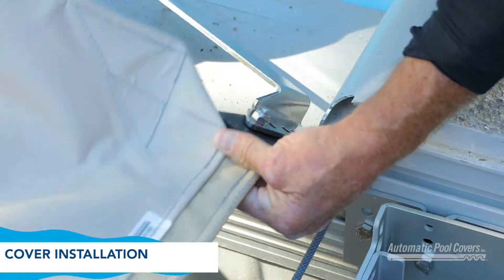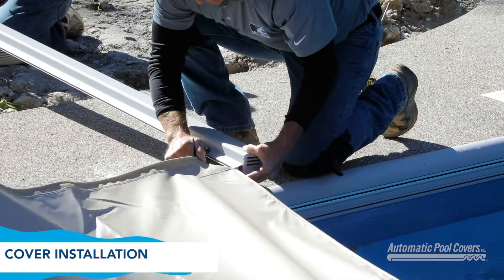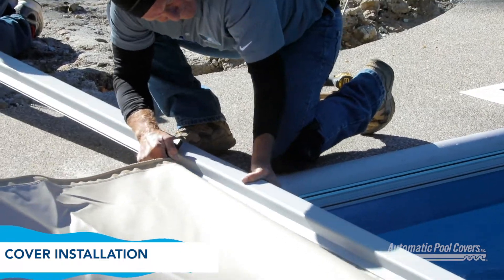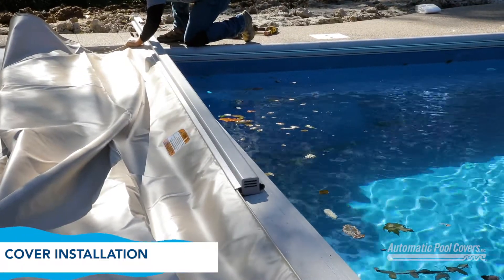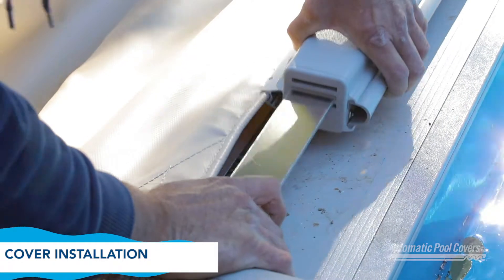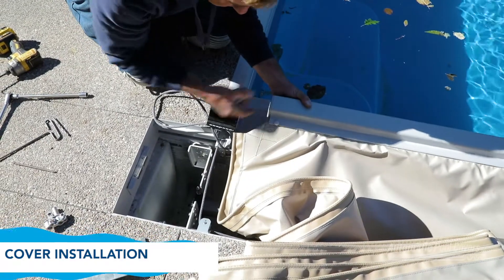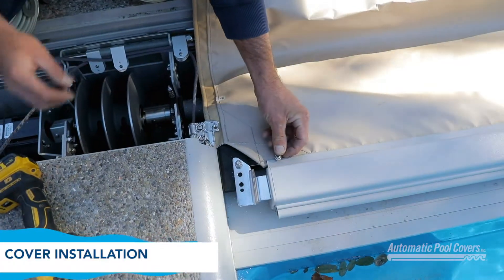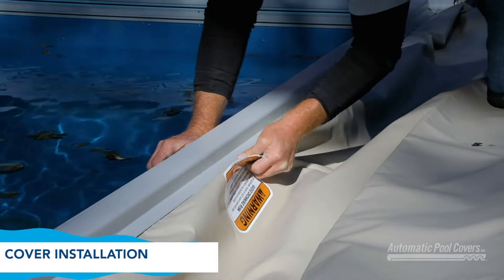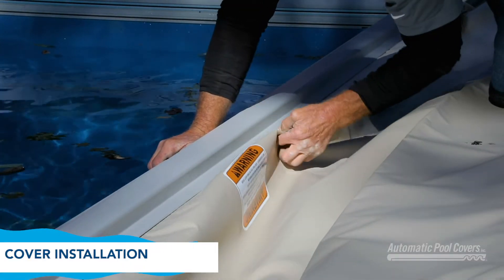Guide the glider and cover corner into the track while pulling gently on the rope. Pull the cover until it is approximately 6 inches into the track. Starting on the opposite side of the previously assembled glider, slide the front edge of the fabric into the lead edge channel. Hold the fabric taut and slide the lead edge until it reaches the glider bracket. Insert the glider bracket into the appropriate slot and slide the lead edge in as far as possible. The cover should extend beyond the lead edge. Adjust the cover corner within the lead edge at the opposite end. Insert the lead edge screw and screw cover through the lead edge channel into the front edge of the cover. With the lead edge screw and screw cover in place, starting at the carriage side, pull the slack from the front of the lead edge into the lead edge channel.